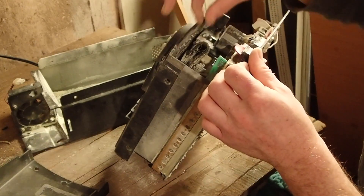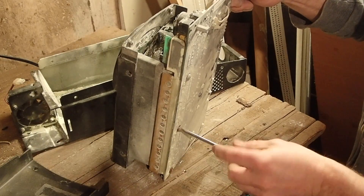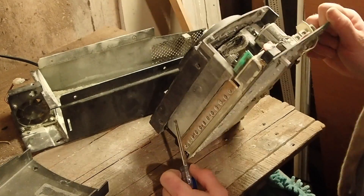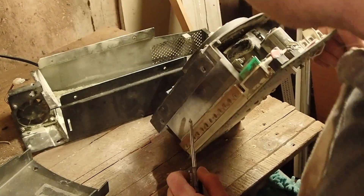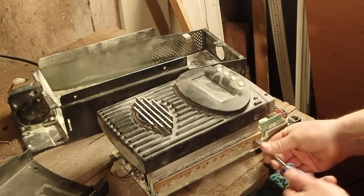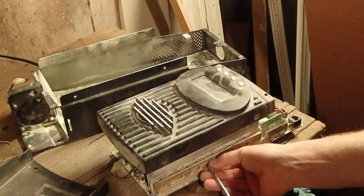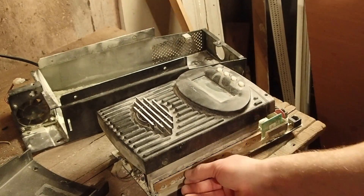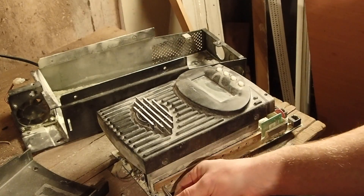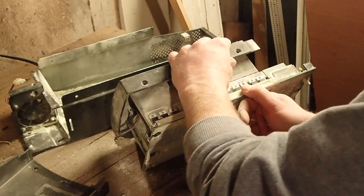The task becomes: how do I get that top aluminum plate off? There's a pile of screws — you have to take off all the MOSFET screws all along the side and some long screws along the board. There are about 15 MOSFETs — the little voltage regulators — all along the side, all flush with the aluminum housing to dissipate heat. You've got to take out all these screws to basically disconnect the heat sink on those MOSFETs.